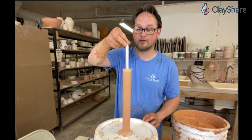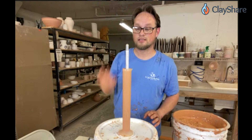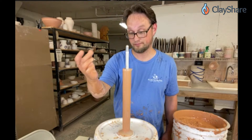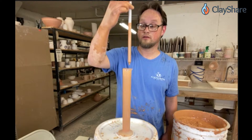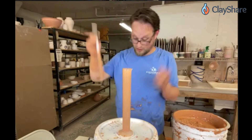Starting at around 1.70 on the scale, letting go gently, and watching it sink... it settles at just over — actually almost perfect. Pulling it out, the scale reads 1.45. So we're done — we've hit our target specific gravity for the nutmeg glaze.